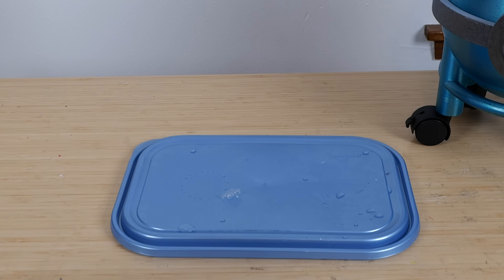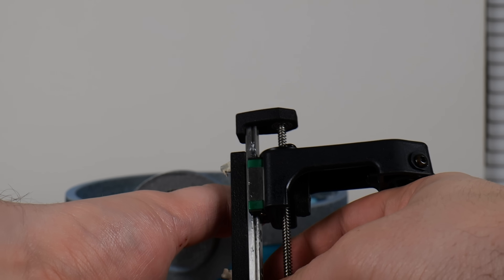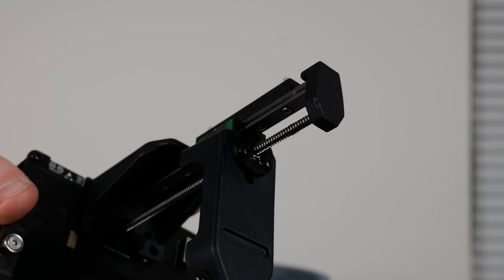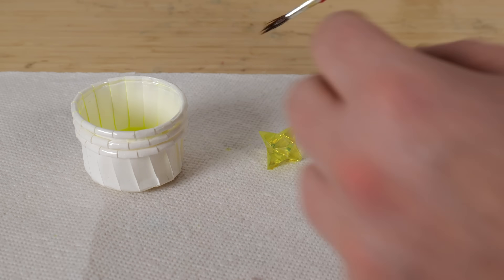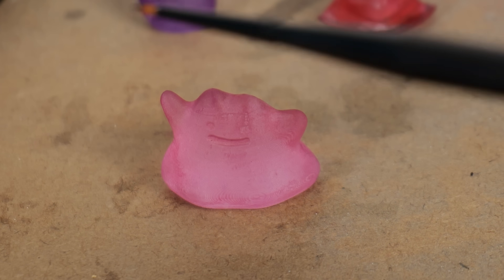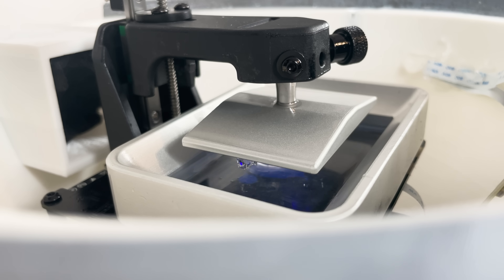Now, I'd like to say that this was all quick and easy and I had such a fun time. But it wasn't. For every successful print, there were about 3 or 4 failed prints. And at one point I think I got some resin inside of the Z-axis motor, and troubleshooting that issue took way too long. But eventually, after cleaning that out and making everything work decently, the next step was to coat everything in some alcohol ink so it would still keep that transparency look. And after it dried, to still make it as translucent as possible, I used a can of acrylic glossy spray. And for some of these prints, painting by hand is not my forte, but I really had to lock in for some of these fine details.